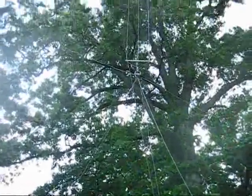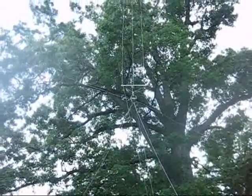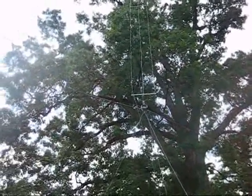Hey guys, AB-8XX here. I've put up a different antenna. I made what I like to call a parallel ground plane. It's a tri-bander — 20, 30, and 40 meters, quarter wave — and I've got radials coming off of that.